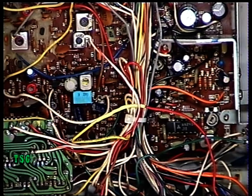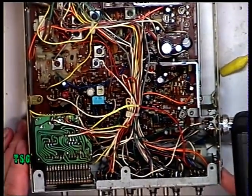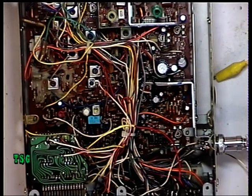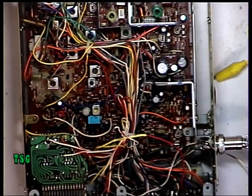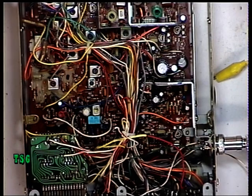There we have it — a set that wasn't working, had an illegal modification, and after two capacitors, a new synthesizer chip, and some time is now working. What I now have to do off the video is restore the public address function — the wiring is dangling out here and we'll look at one of the other sets to see how that's wired. So there you have it, the Rotel RVC240, which we will subsequently do an on-the-air video of. Thanks for watching.